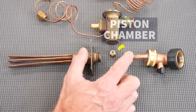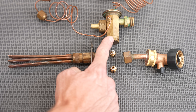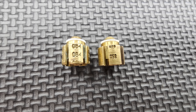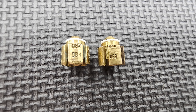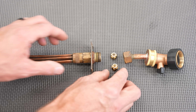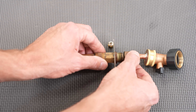This here is a piston chamber. When you remove the piston you can have it accept a TXV instead — this specific TXV type mounts right into the piston chamber. We have two pistons that are dramatically different in size, and I'll show the water-stream difference between them, though they won't have as much control as a thermostatic expansion valve.